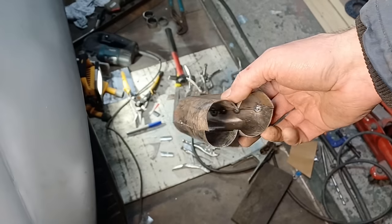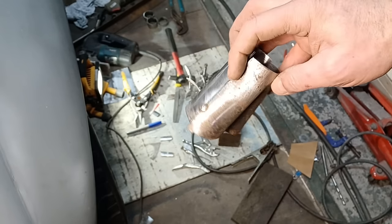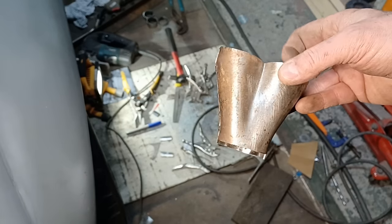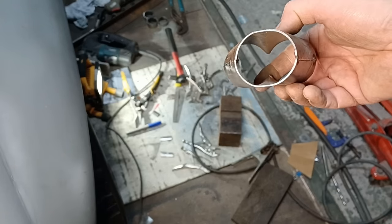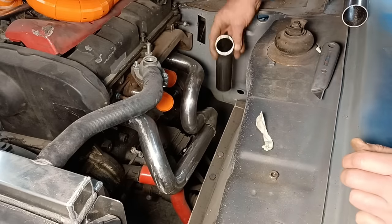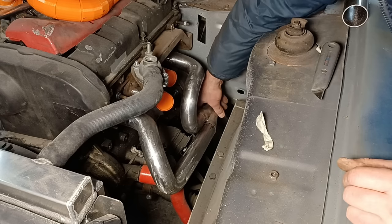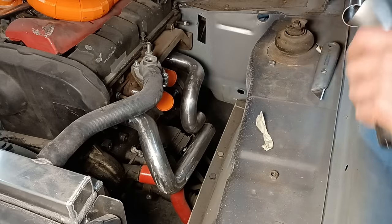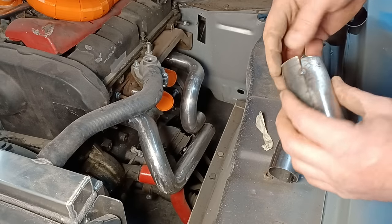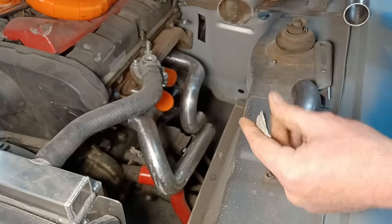That's basically the idea. Once I got it actually in place I've been trimming up the edges — it's quite a rough cut but that's basically what we want: a two-into-one connector. That little beauty will fit under there, so it fits on the end there. I'll trim this up so it looks tidy, nice and straight around those edges, then we'll come back and tack it up into place. This sheet is about 1.2mm and the pipe is 1.5mm so we should be okay for gauge.